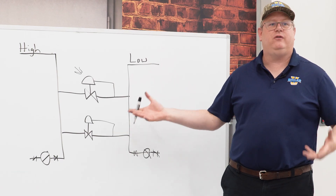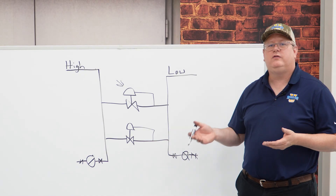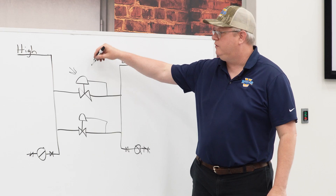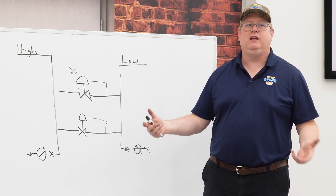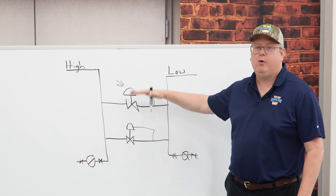If we're trying to hold five pounds on the outlet, we can't make them five pounds apart. But what we want to do is have some difference between the settings so that in low load situations, the bottom valve is really not doing anything — it's just sitting there waiting to be needed — but we control with the top one.